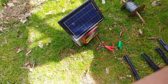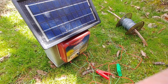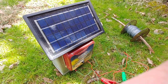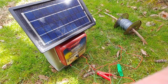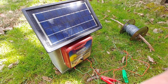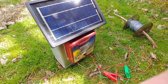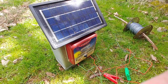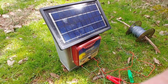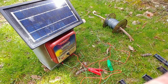The next thing you're going to need is a controller. I use solar controllers, and I just went over why — pretty much anywhere I'm going to need this setup is not going to be near an electrical outlet. I don't want to run 1,000 feet of extension cords, which is a fire hazard. So I just pay more and get solar chargers. I actually have about six different ones by two different brands. This one's a PARMAC; the others are made by Premier One — they sell a lot of electric fence netting. I always try to keep one spare, because this is my emergency go-kit: the wire, the charger, the posts. I can put up an electric fence anywhere in five or ten minutes.